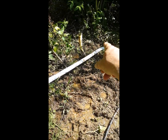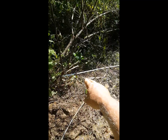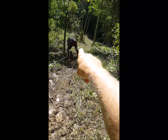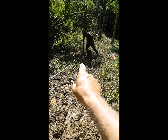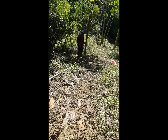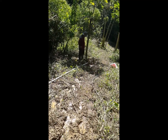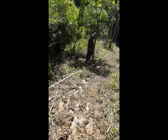It goes down and there's an elbow transition, 45-degree, into this 1-inch plastic and steel drive pipe that goes down to the hydraulic ram pump. Here we have a low pressure plastic pipe, a medium pressure plastic pipe, and then 3 galvanized iron pipes. All of them are 1-inch diameter. They're 6 meters long, so 6 times 5, we have 30 meters of drive pipe